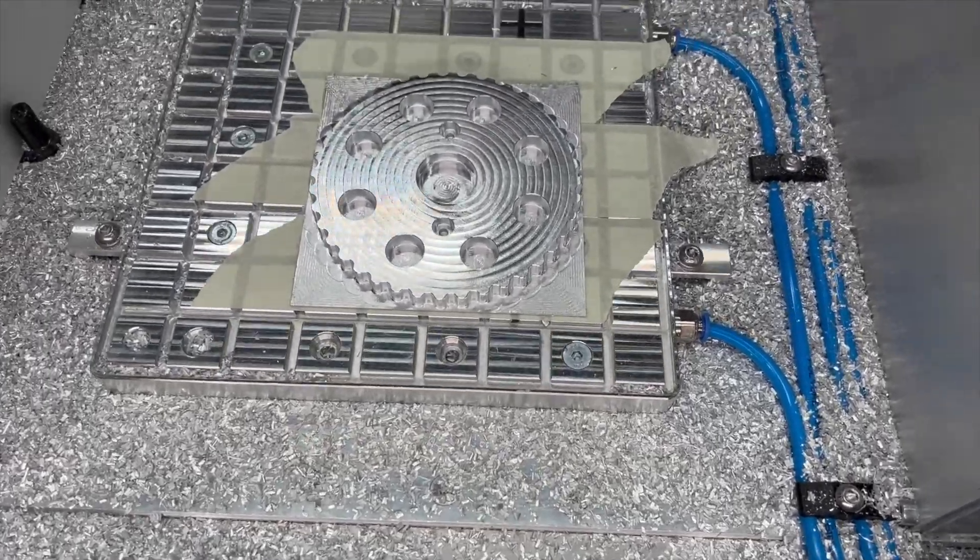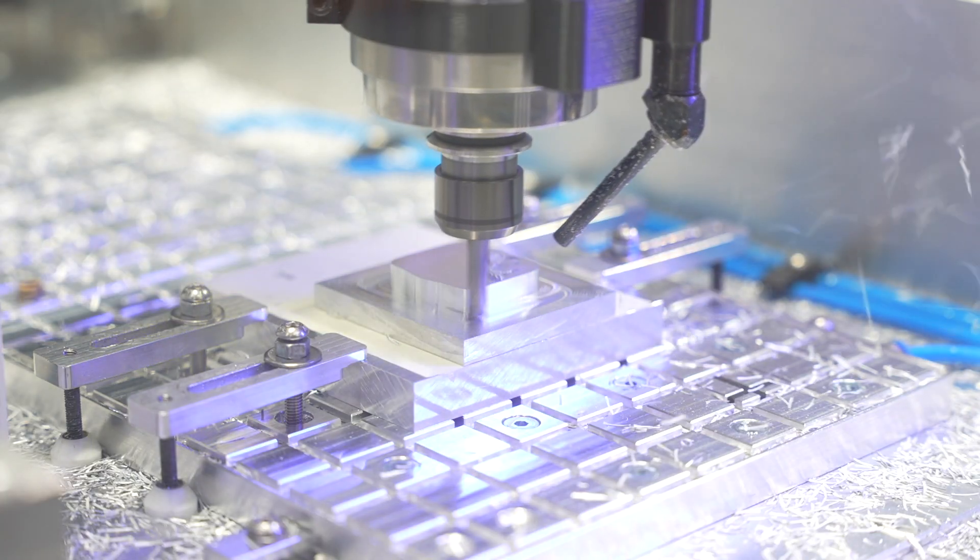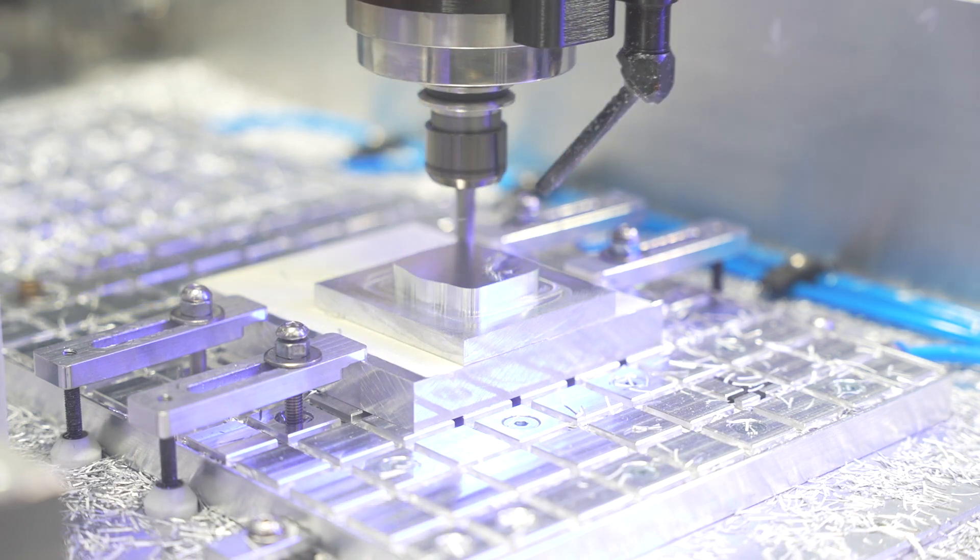When you're finished and want to remove the part, the bond is very strong. The only way to get it off properly is to heat it up — you can use a heat gun. And don't apply much force, because thin parts will bend.